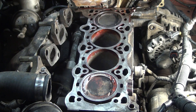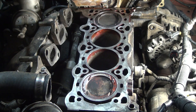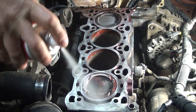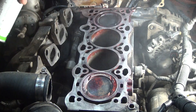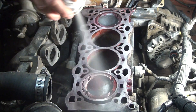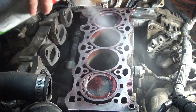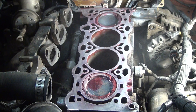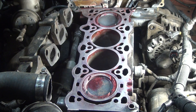They make different colors of developer too. You do spray this one on — shake it up just like a spray can. It's kind of hard to get a good coat because it doesn't spray straight up and down; you have to hold it at an angle, similar to brake cleaner. You just want a nice even coat, nothing crazy. Now you can check and see — if there's a crack it should show up.